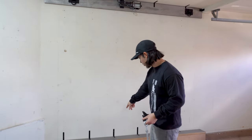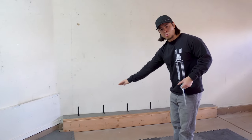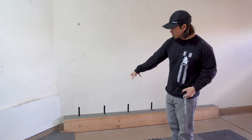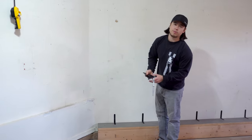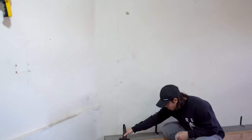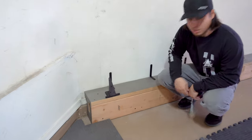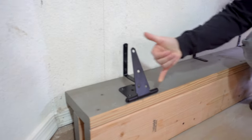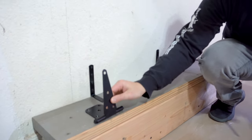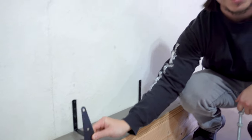That will have the chain attachments and the winch. The second step is the kickboard. So down here is gonna be a row of feet, but also the base of the wall. So on top of this will go these hinges that will hold the frame of the climbing wall, like so. So this is sturdy, won't be moving anywhere, and then the wall will mount to this and hinge on the hinges as the winch and the chains change the angle.